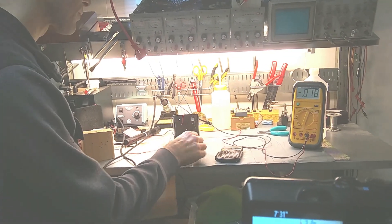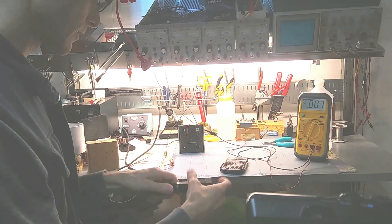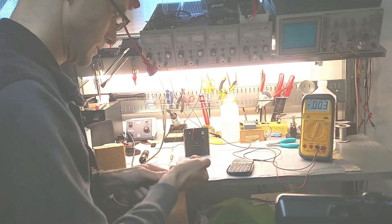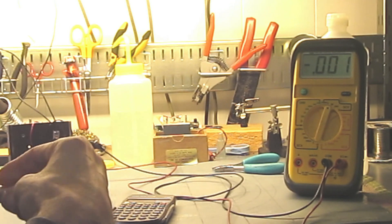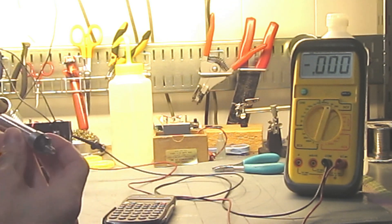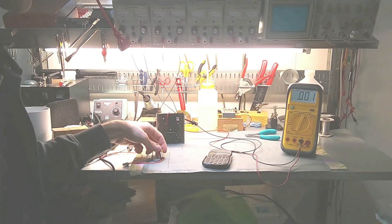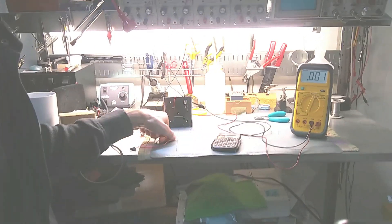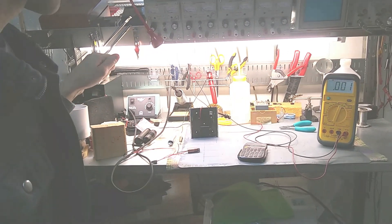So that's five watts out of that guy. If you go to DTR's laser shop, he's got this model listed with pictures of the power, voltage, and current — at that current level you'll see it is about 5.3 watts. That's how I ended up calibrating this. This one is noticeably brighter. Incidentally, if I take this apart and run it off the power supply directly I can get 3 watts out of it. This one is supposed to get up to 7 watts or even more if you cool it well.